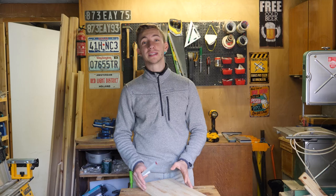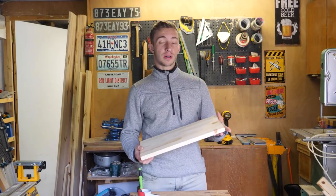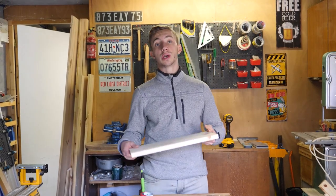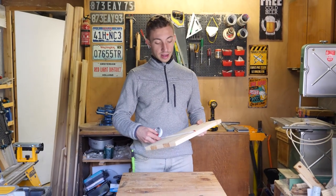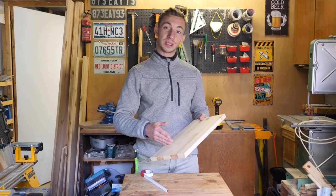If you are interested to make this project, then let's go. The first step is to find the sections of wood that we need. I will use a offcut that I found in the atelier. I need two sections: one section that will be 20 cm long by 15 cm wide, and another section that will be 5 cm long by 15 cm wide. I have a offcut that is about 19 cm wide — I'm going to mark it to have 15 cm wide, and then we can re-cut the length.